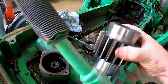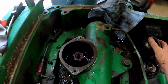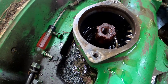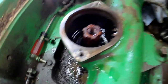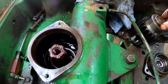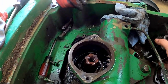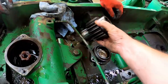As you can see, the bolt is kind of captured in there on tapered splines. There is a quad ring down on the bottom of the box — that's what's letting the oil seep out on this one. If it's coming out the bottom it's got to come through that quad ring, or the other option is the cap that goes in the top, which seals the oil from going down around the shaft. Usually it's that quad ring.